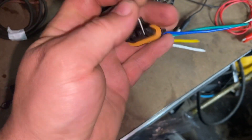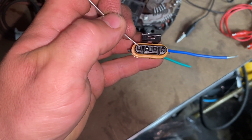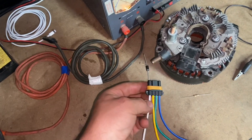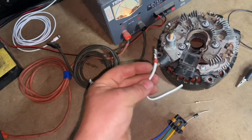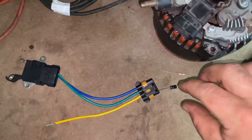I use these little diodes — they're hard to do with one hand — and slide them back in right here on the terminal. I'll slide that back in there. Because I'm too cheap to buy the right tool. With that in place, I need to remove the terminal we don't need, so that wire is gone. We'll do the same for the green wire.